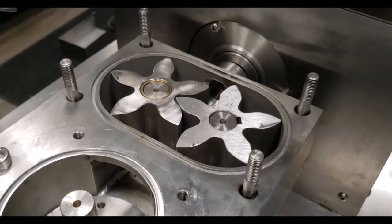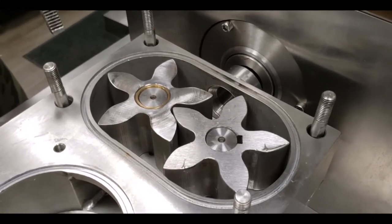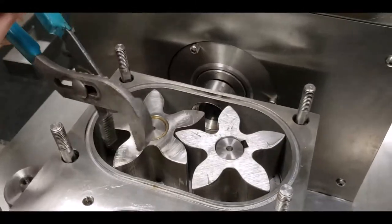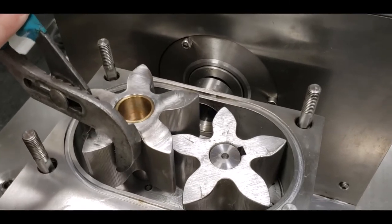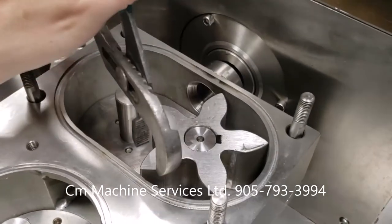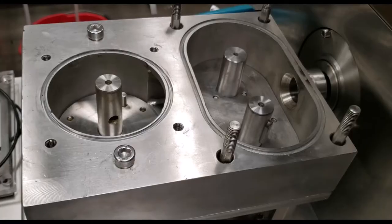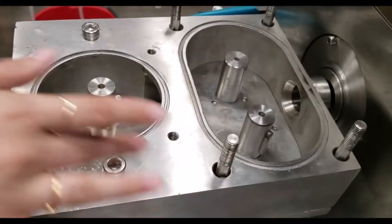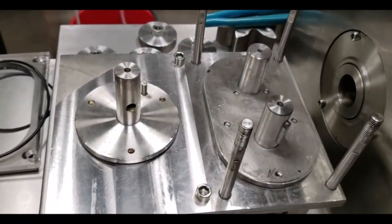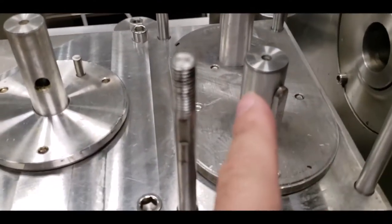At this stage we're going to show you how to remove the Inner Filler 2. Normally you have leftover product still inside the chamber. What you want to do is use this type of tool to pull up the parts. Once it's pulled out, it's easier to access the other one, and the same thing goes for the other part — it makes it easy for cleaning at the end of the shift. Once all parts are removed from the block, you can actually remove and release the block for cleaning. You can clean the bottom and also clean the block. Continue to pay attention to your keyway here — not to lose your keyway.